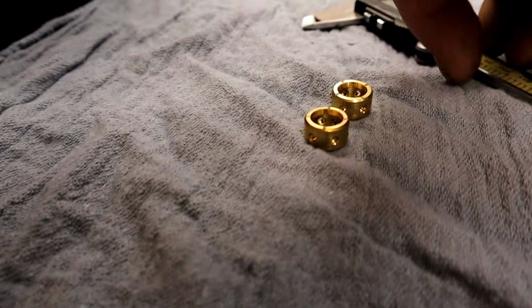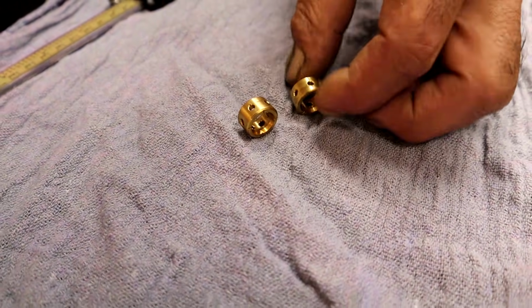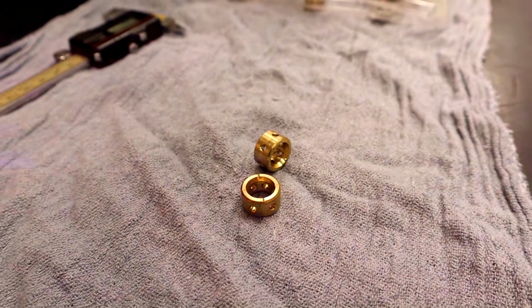Their bearings, I like to say it's kind of a misconception because it looks more like a bushing. Bushing, yeah. But that's actually the bearing. That brass? It's a brass bearing. The newer stuff now, high dollar turbos, will come with actually a rotor ball bearing. Ball bearing turbo someday, but that's something totally different.